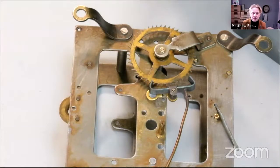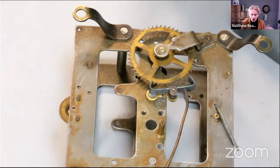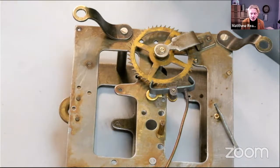for the tips only. You're only looking at a couple of millimetres, maybe 3 or 4 millimetres max that needs to be hardened. So what I'll do is I'll protect the rest of the pallet with a bit of cloth that's soaked in water or cool gel or something. And yeah, I think I will re-harden them and then just leave them dead hard and then they're done. But I'm not going to do that until the whole thing is finished because, and you might have to remind me because I'm bound to forget,